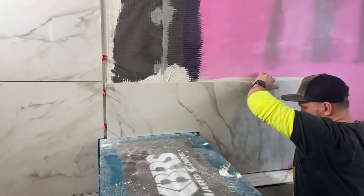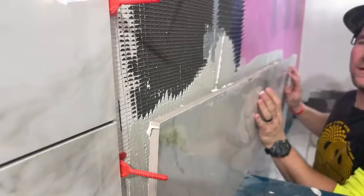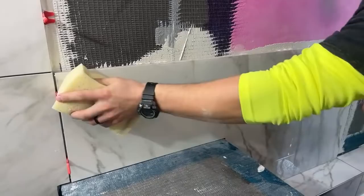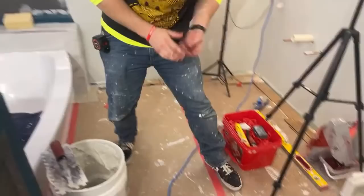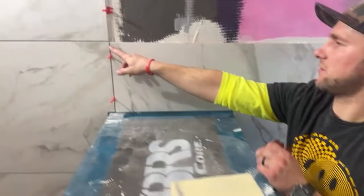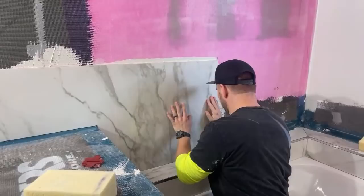All right, so I'm gonna start out outside of it. You see we're about an inch out. I'm gonna give it a good little spank and push that in. Right there. Our wall is a little bit bent here, so that's why the tile leveling system will pull that out over here. Now you want to make sure to get your tile off this tile, so I'm gonna turn my laser on here. You see I'm right inside this grout line, so I want my tile to be just below that. On this side, we come up pretty good.